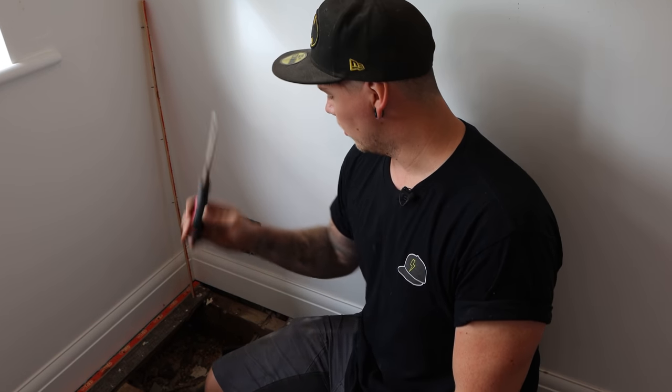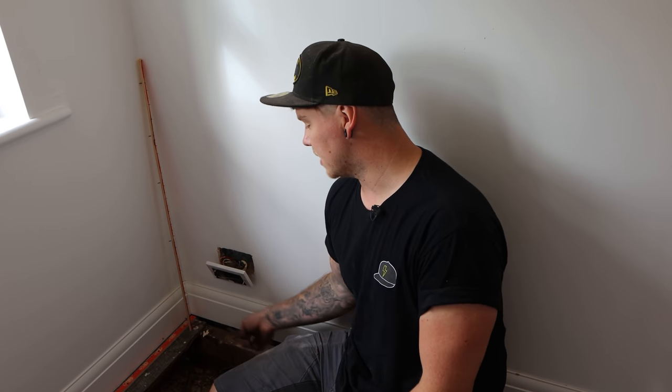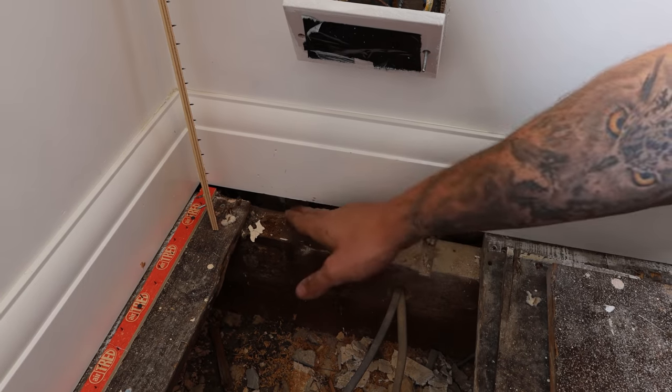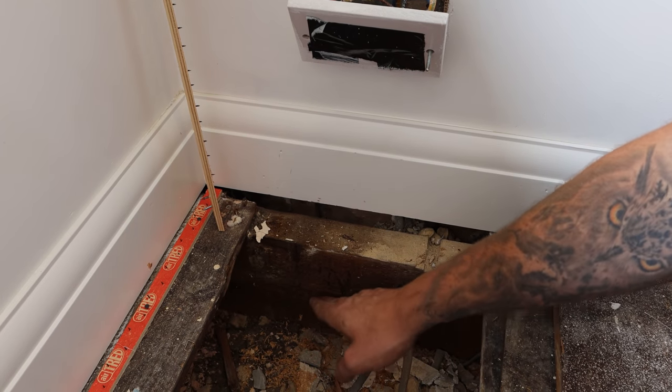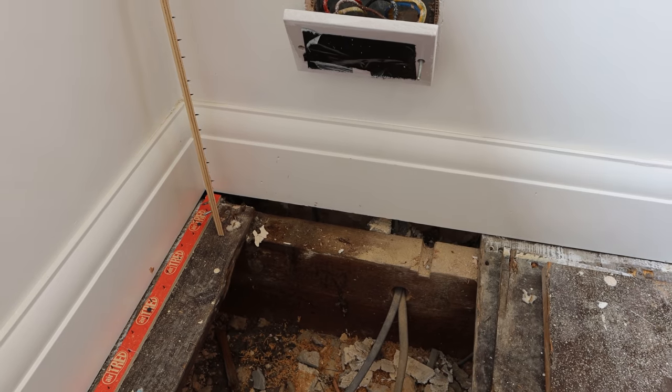So the boards are coming up. I've chiseled up in the corner here from downstairs. But unfortunately, there's a beam right next to it. We haven't got a gap instead of the beam being against the wall. But I've got to get four cables up this gap, find it first. We'll drill at an angle, probably 32 mil spade bit, on an angle down, so we've got the angle we can sort of feed up and get fish down.